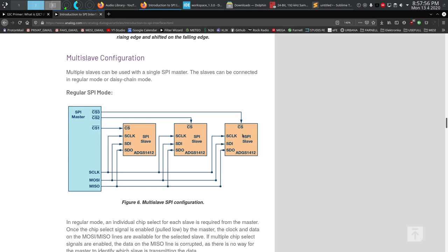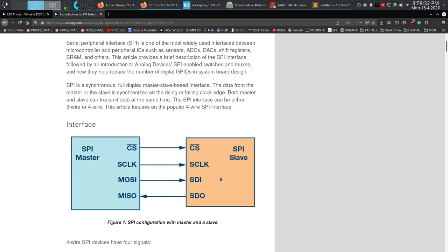The minimum number of wires is four: three data lines plus one chip select per slave. Unlike I2C where you only use two lines regardless of how many devices, with SPI you need 3 plus N lines, where N is the number of devices. We control communication using a physical hardware pin, so we don't need to send a device address byte like in I2C — saving that first byte is one reason SPI can be faster.